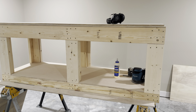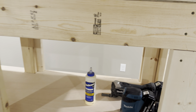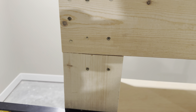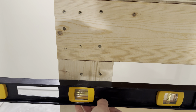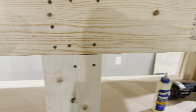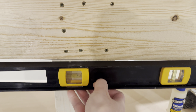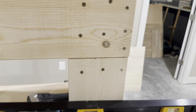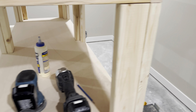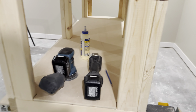Before I fit these panels, everything has to be perfectly level as far as all the framing. This one here has been sanded to make it perfect. This one might look close but it's not — same with this one. On the bottoms they're fine, but on the tops, when you run a level up there's a little lip. The middle one has even more of a lip. If you're not putting any wrap around this it's fine, but that little lip needs to go.